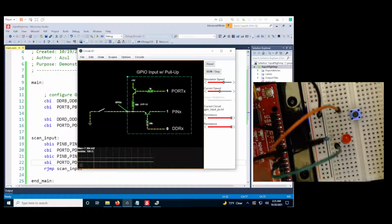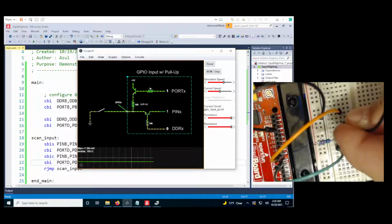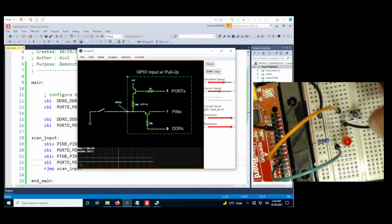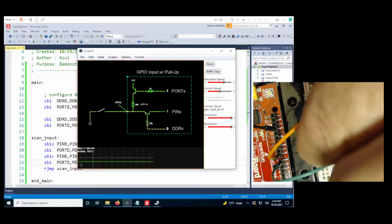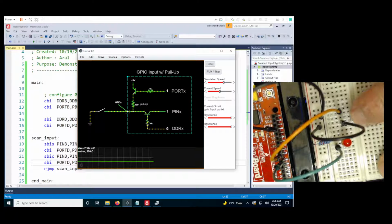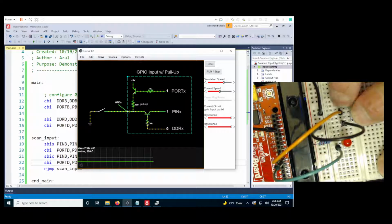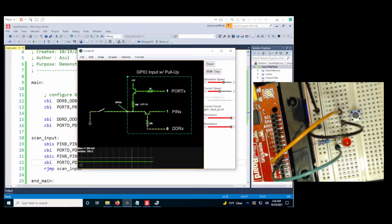So I'm just going to hook a new wire in terminal 17. And I'm just using a black wire to signify ground. And I can put that into the ground rail anywhere. And so now when I push my button, I will pull voltage that's on the orange wire through the switch to the ground rail. And then this ground here is going back to my board, which I'm going to disconnect from the board so that it's not connected when I'm programming. Nothing else in the circuit needs to change.